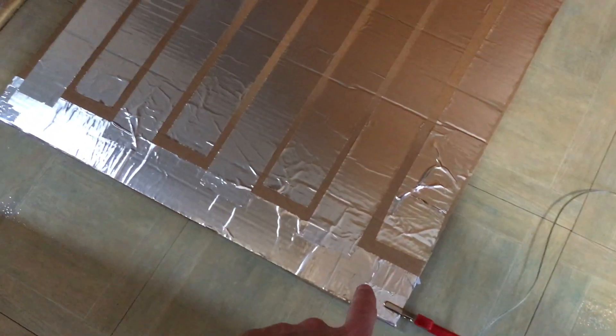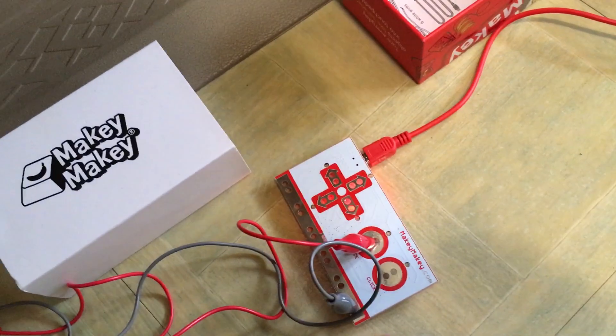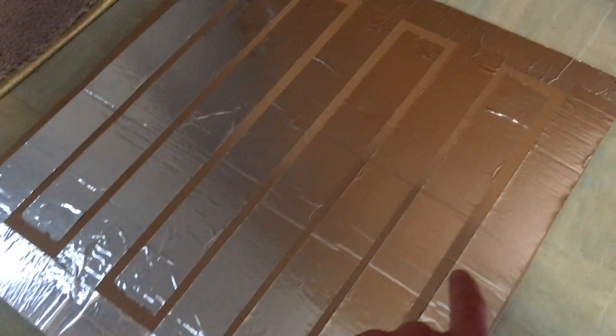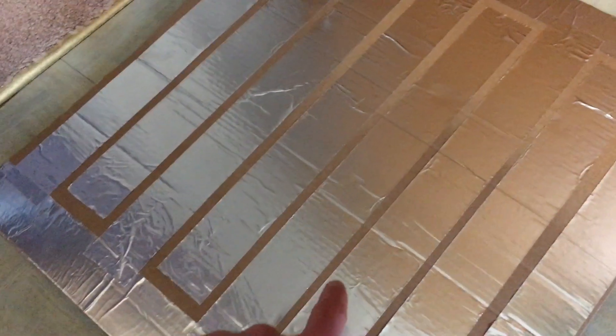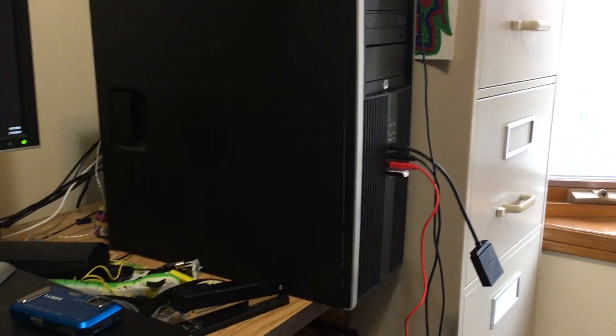The cardboard has some metal tape, and you can see that the metal tape is connected to the red wire on the space key. Another terminal is connected to another alligator clip which comes back and is connected to the earth connection — the gray wire down here. The two connections never touch; the metal tape on this side is always separated by a gap. So when somebody steps on it, the circuit is connected. And even with socks, this circuit is connected effectively, making it work. This is then hooked into the computer — very effective.